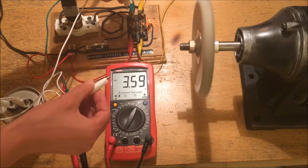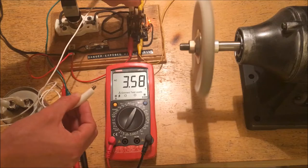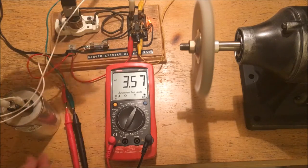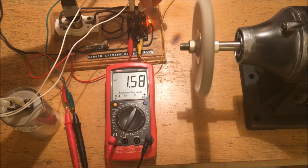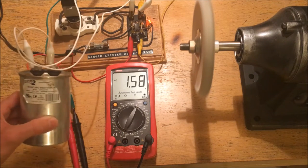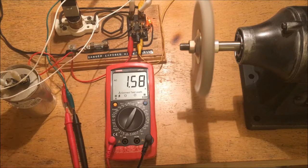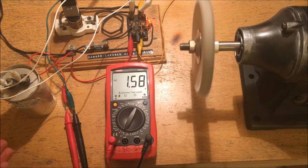I'm going to connect one side first, like so — being careful not to touch more than one thing at a time, because there is mains voltage involved here. And look at that: the amperage has dropped just about in half just by connecting this capacitor across the power supply. Now how can we account for this? It doesn't seem like you should have less current being drawn when you add more stuff.